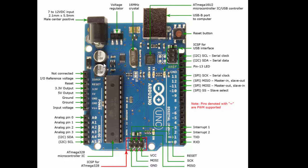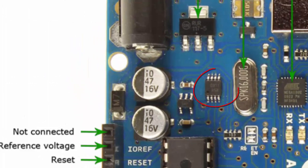There is a comparator IC on the board. When you supply power both from a USB cable and from the power connector, the Arduino board gets confused about which voltage level to use. The comparator resolves this and its output is given to the microcontroller — that is why the comparator IC is used.